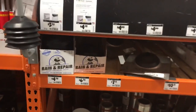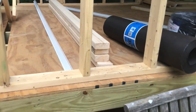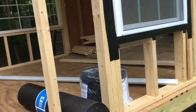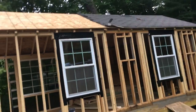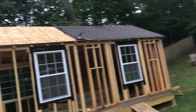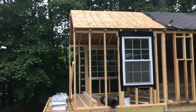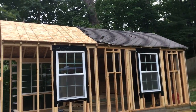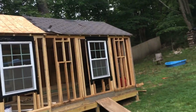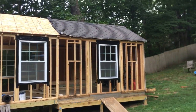I got all the materials: roofing paper, ridge vent, and the drip edge. I grabbed a couple of two-by-fours. You put the drip edge up front first, then paper on top, and then your side gable drip edge goes over the paper. So the front drip edge is under the paper, sides go over the paper. I'll show that when I get to that part.